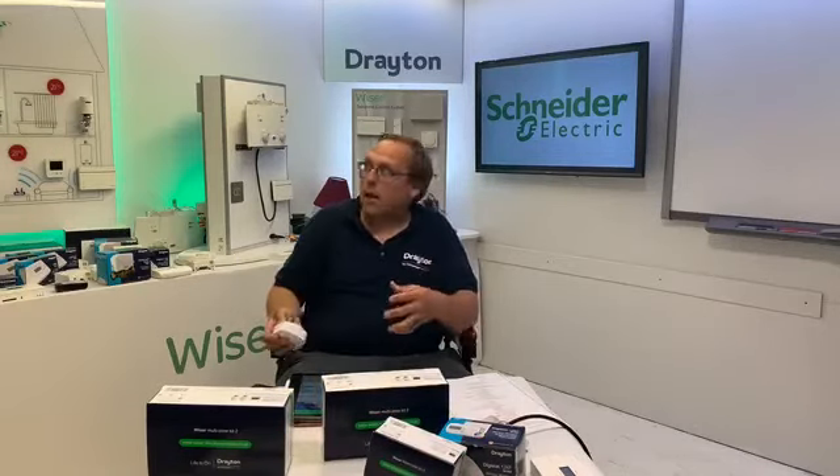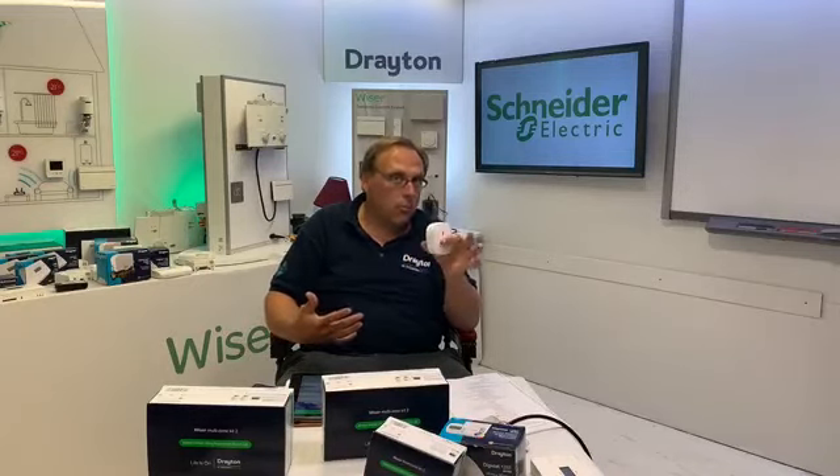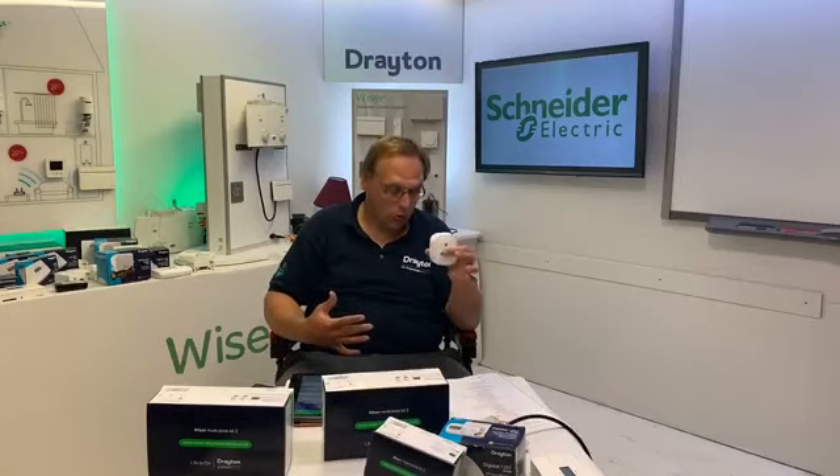Other considerations: RF and Wi-Fi. The hub broadcasts on a separate network, so as well as Wi-Fi coverage, you may need to consider Wiser plugs if it's a big property. Certainly if you think it's going to be a challenging property, you need to take extra measures if you're going to upsell Wiser rather than a traditional control.